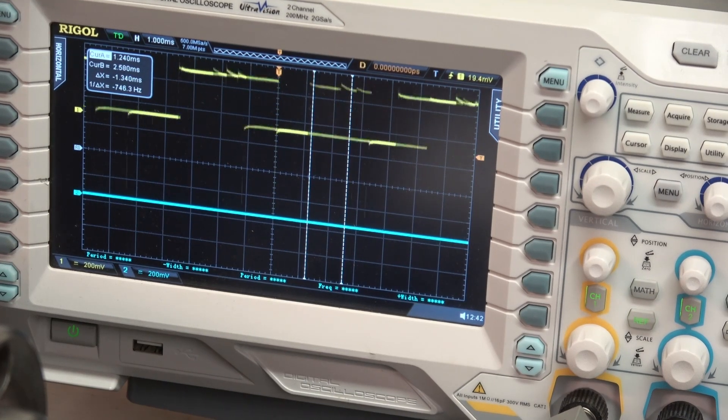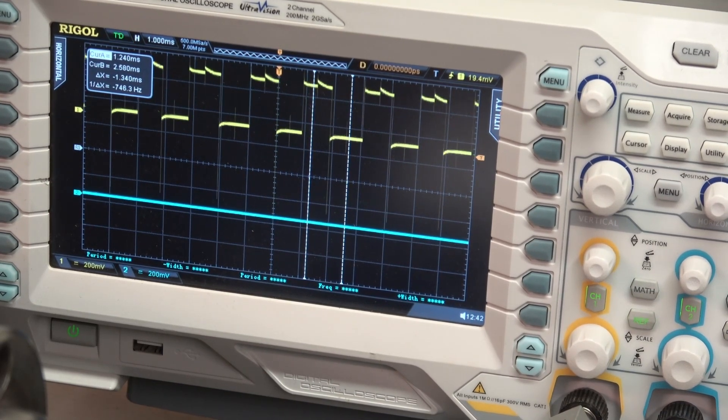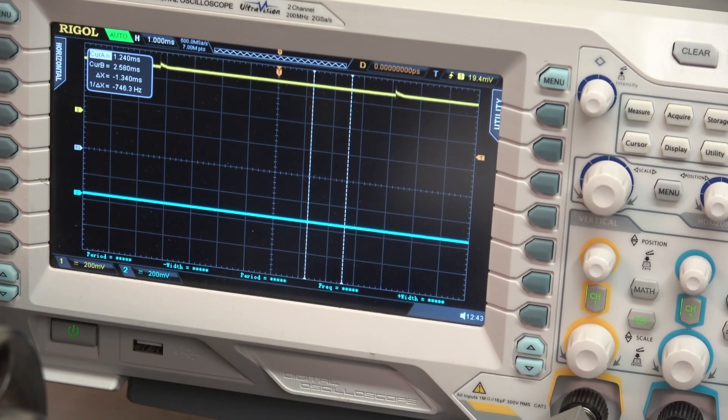To prove it, I'll disconnect pin 4 and see if that fixes the problem — yes, it does. With this unknown pin 4, which the manual says is a ground but actually may be some signal, if I remove that, everything is working okay. So I'll open the connector from the scale and clip the wire on pin 4, since I don't actually know what that is.